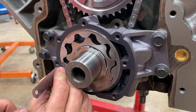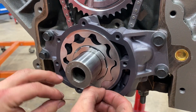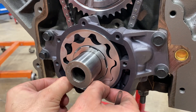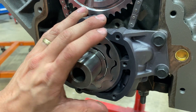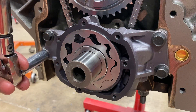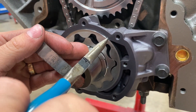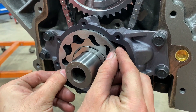If you take another feeler gauge, you'll find that you can easily move it on the other sides of the gear where you don't have a feeler gauge, because the edges of these two little strips of metal are basically centering the gear perfectly. I'll just tweak this bottom one a little bit. Then I'll come back and torque the bolts down to 18 pounds, lock the housing in, then we can pop out our feeler gauges and it's now perfectly centered. Now that that's done, we can just grab our feelers and pull them out of the gear and housing. If you've done it correctly, your gear should be absolutely totally free from the housing all the way around.